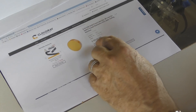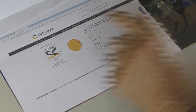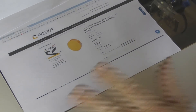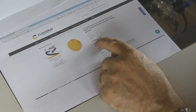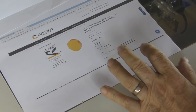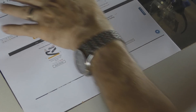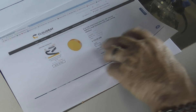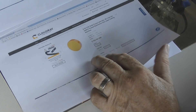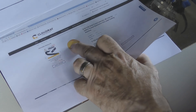Wow — from that same industrial company we're asked to pay $750 for a lens. Looking carefully, this is for a Trumpf or Bystronic cutting machine — both industrial quality high-power machines: three, four, five kilowatt machines. So this is nothing to do with us. This particular company sells to good-quality industrial machines as well as the lower-end hobby market. But you'll notice it's still ZnSe — zinc selenide is capable of going up to kilowatts if it's the right quality material.